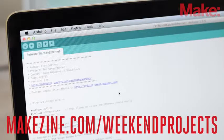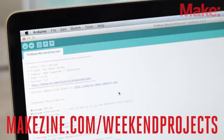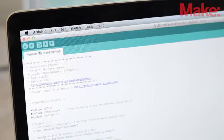Now we need to program the Arduino microcontroller. You can download the source code from the link found on the project page. You will also need to install the tweet library for Arduino and get an OAuth token. The project page has all the code and links to get you up and running quickly. Once you add your OAuth and network information to the code, upload it to your Arduino.